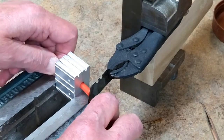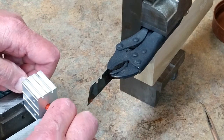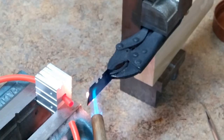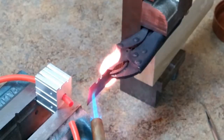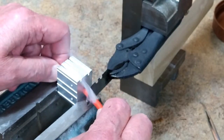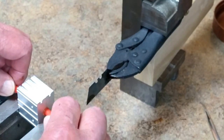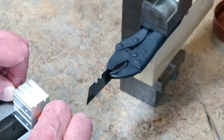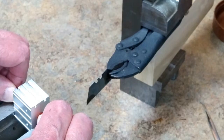Then I will bring these close to the blade and push both ends until they melt, slide it out, get away from that hot blade, and then shove this into my jig. Being a one-man operation, that's how we're going to do that. I'm going to keep pushing on that for about a minute, and hopefully that aluminum jig is holding these two pieces in alignment. It's also acting as a heat sink to pull the heat out of the urethane, so that joint cools off a little faster.